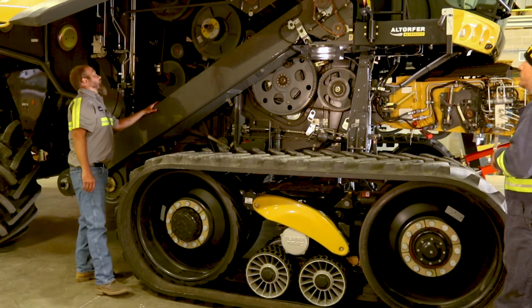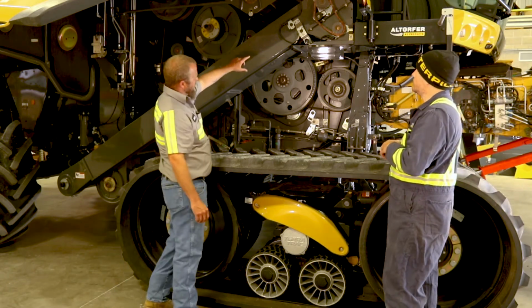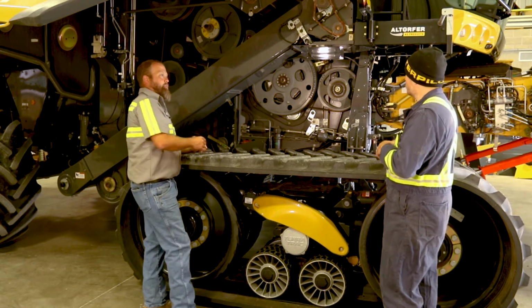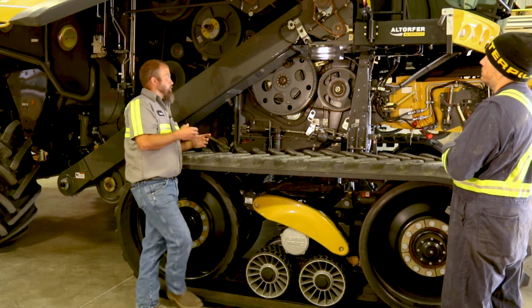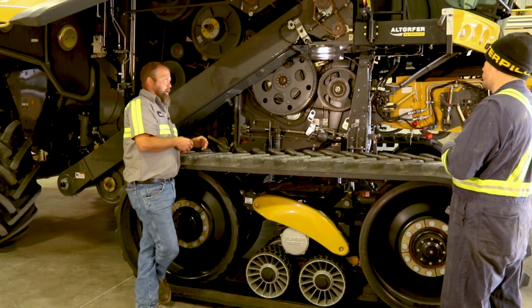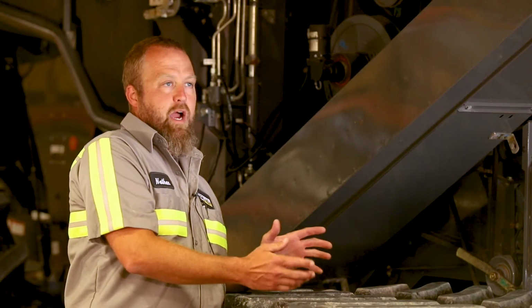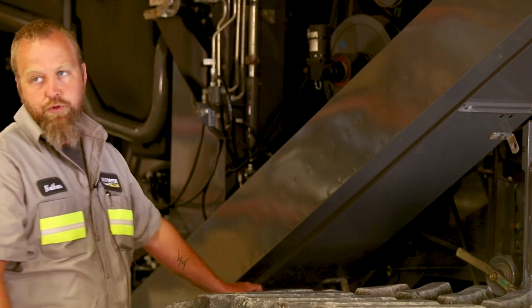Then up above that, you have 2 belt tensioners. You kind of got to go in from the back to see. It's just the same red, tip-to-tip tensioners back there. I've found on them a lot, once you start to tighten them, take an air gun and try and blow some of the crud out from inside of that spring. But if you can blow them out before you start to adjust them, otherwise you'll start stripping that nut and then you'll make it impossible to do it.